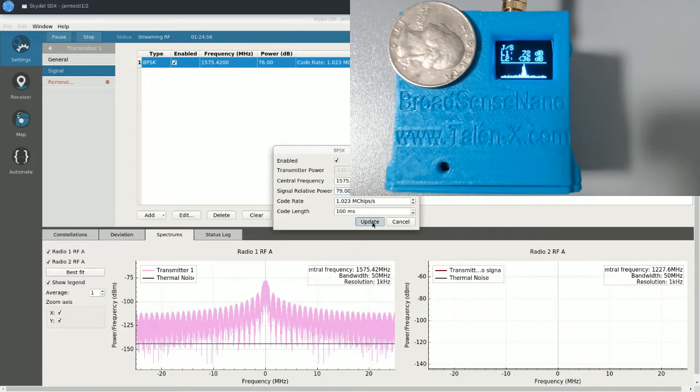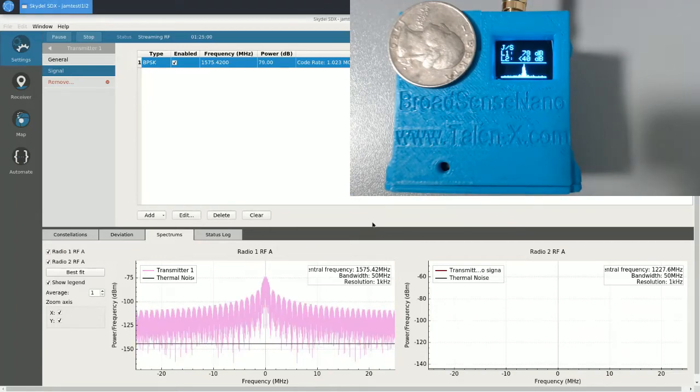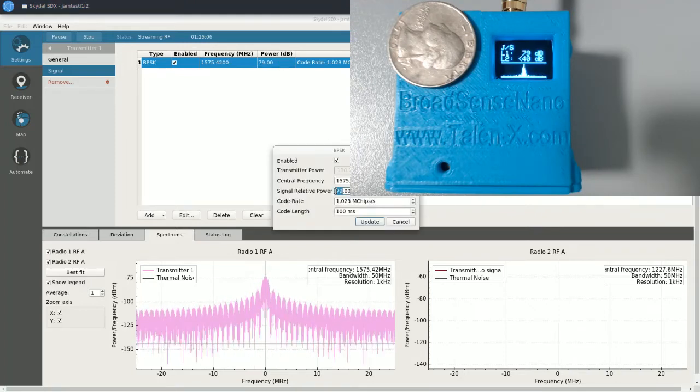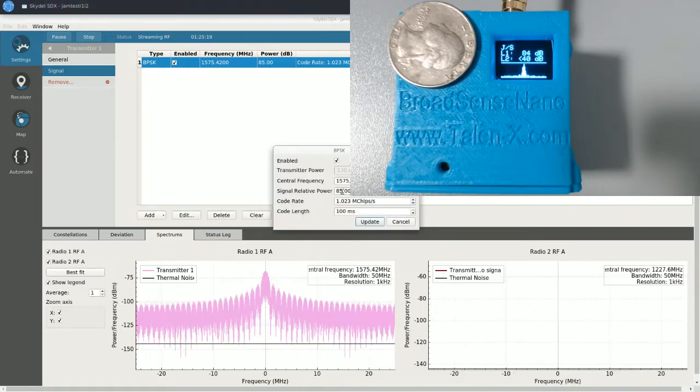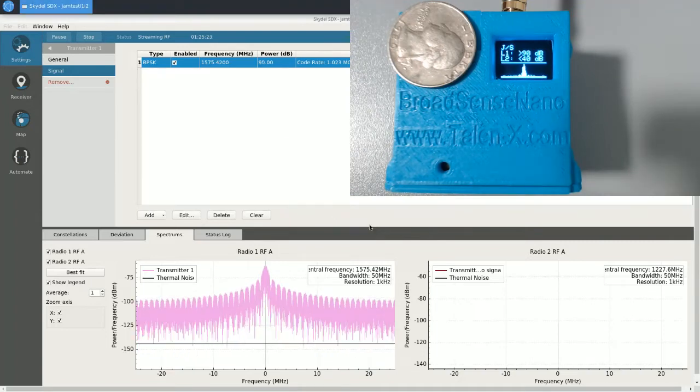Let's try 79 dB — that's looking much better. We're through the difficult part of the curve. Let's try 85 dB — now we indicate 84 dB. We're actually approaching the upper limit of our sensor's capabilities. As we increase the jammer, at 90 dB the sensor indicates that the J to S level is greater than 90 dB. This is our method of indicating to the user that we no longer know how much jamming we are experiencing because we have maxed out our sensor.